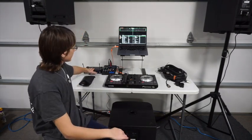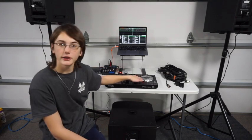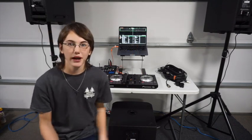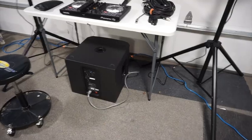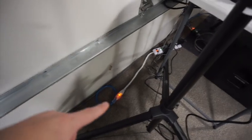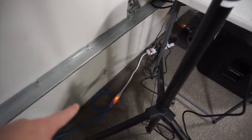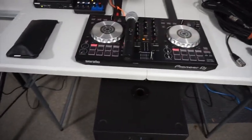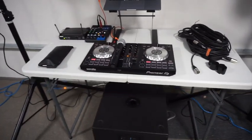At this point I am done giving everything power. My wireless mic is powered, my mixer is powered, and my DJ controller runs off the laptop power so it does not need an external power source. My speakers and subwoofer are all powered — I'll show you guys how I do that. I have this blue cable coming in through here and another one coming in through here. I suggest you always get lighted ends on your cables so you know if you trip a circuit which one you tripped. This cord is running all of my stuff on my table, and this other cord is running the subwoofer and the right speaker. Always make sure you know how much power your stuff draws so you know how many circuits you need.